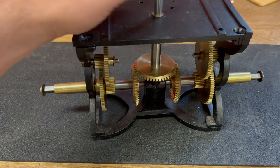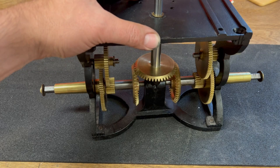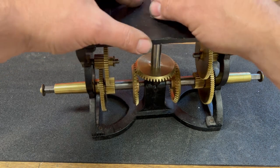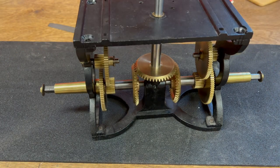That feels really nice. It actually doesn't stick anymore — I haven't greased it yet, but I think that is going to be a noticeable difference in the amount of energy it will take to drive, now that that shaft isn't being sucked into the worn bushing.